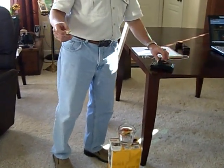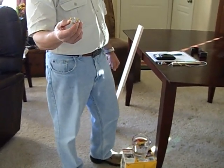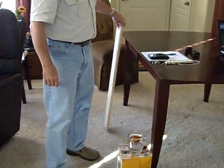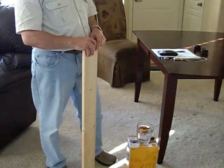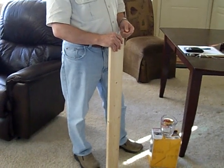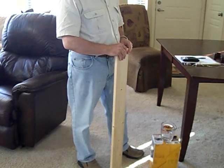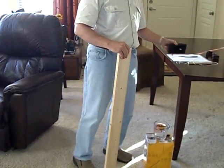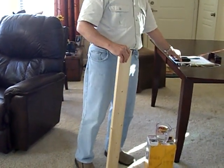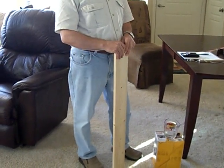The second thing you need to do is find out how much this gold and quartz specimen weighs in water — when it's suspended in water. If you look online, they'll tell you how to do this using a triple beam scale, which costs between a hundred and two hundred dollars. I didn't want to spend that much, so I figured out a way using a regular digital scale, which costs anywhere from twenty to fifty dollars and is more versatile.